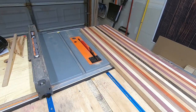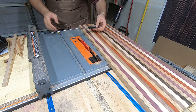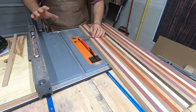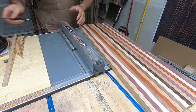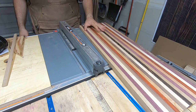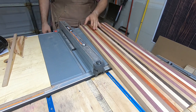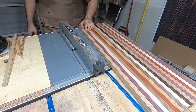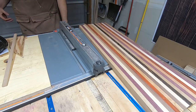That finishes task number one of who knows how many. I'm going to set the fence for the current thickness of these boards — this should give me some ability to mix and match even more. I'll show you that once I've done all the cuts. Also, I went ahead and switched to a ripping blade. I had some issues where I felt like some of the woods were getting bogged down, so hopefully this will help that out. I'm going to go ahead and get on with the next set of cuts.